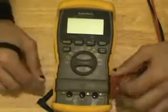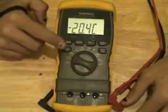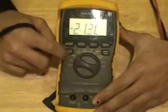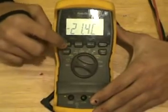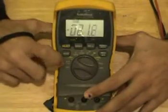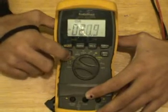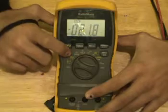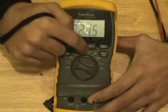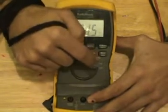This can also do temperature. It's a bit more modern — you can hit the shift function and it will alternate between primary and secondary functions, just like the FN key on a laptop. There's gray text on the bottom and yellow text on the top. So this dial position can be either voltage or temperature in Celsius or Fahrenheit; another can be analog voltage or decibels. We can do microamps, milliamps, full amps, resistors, capacitors, continuity, diodes, logic, frequency, and transistor.